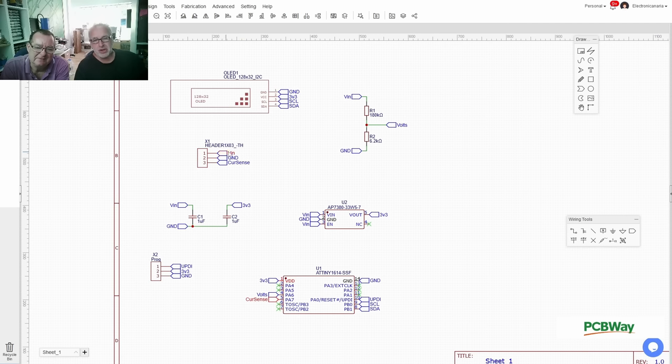Then we have voltage in over here, and voltage in has some paths to go. For once, it goes down this resistive divider, and these are some really crooked numbers, 180K to 6.2K. This comes out to 29 to 1. So if we get 30 volts on the inputs, we get 1 volt on the outputs, in reasonable precision.